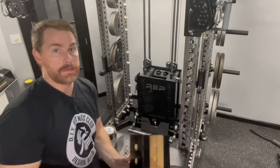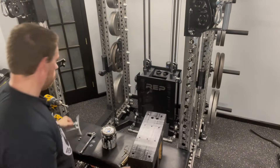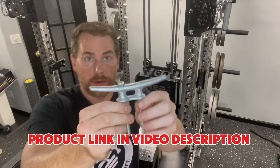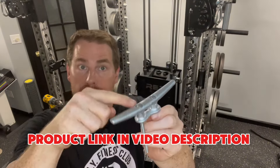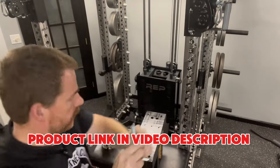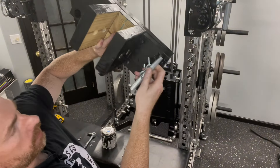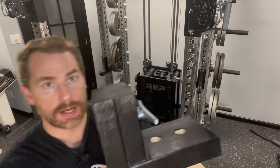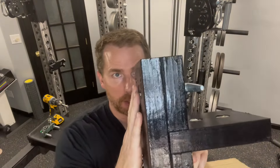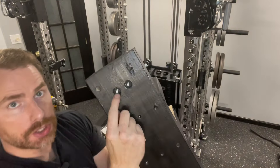The paint is now dry and it came out looking awesome. Now mount the rope cleat using quarter-inch four-inch-long bolts through the back — they're flat so they don't stick out. Put a washer and a nylon lock nut on each one.